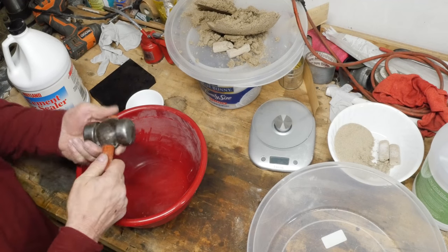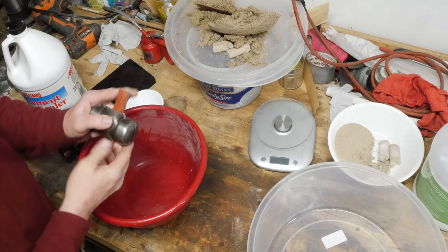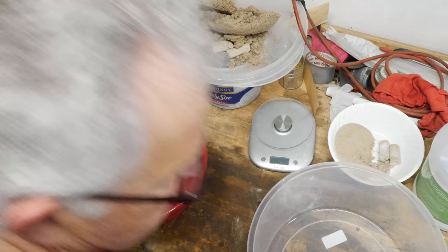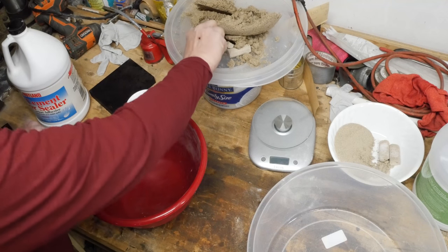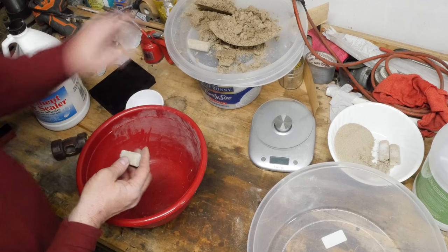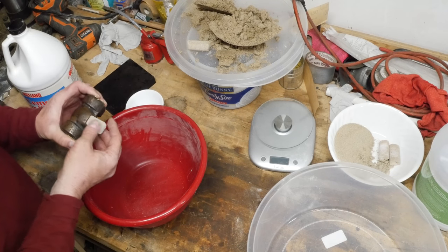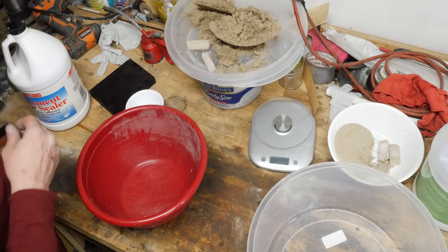For example, if this is made of wood but it fits the hole, I can use it to fill this part in while I pour metal around it. I obviously can't do that with wood, but I can do that with sand. Here's an example of a core that wasn't quite so successful and broke, but you get the idea — this would go inside here, fill this up, and I would pour metal around it. So let's look at what I use.